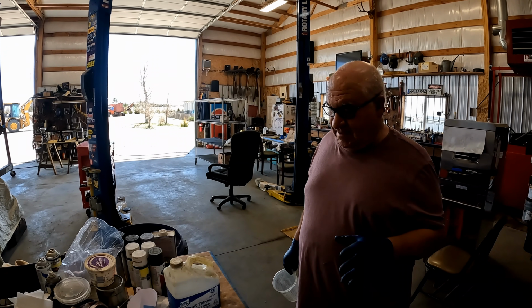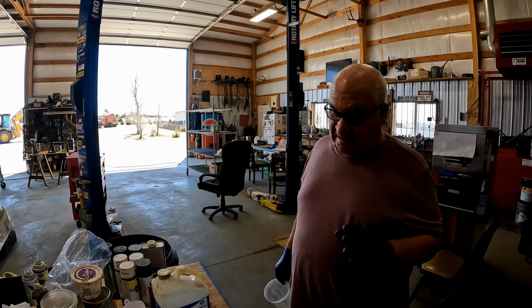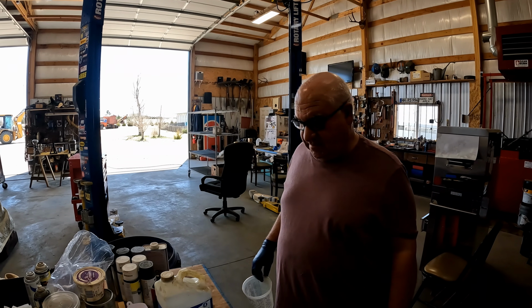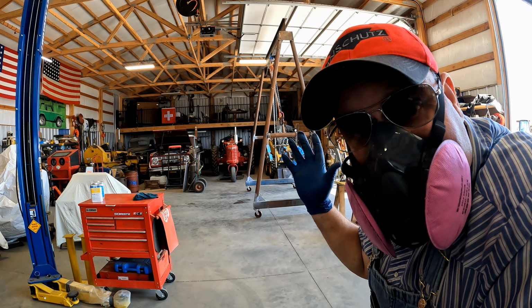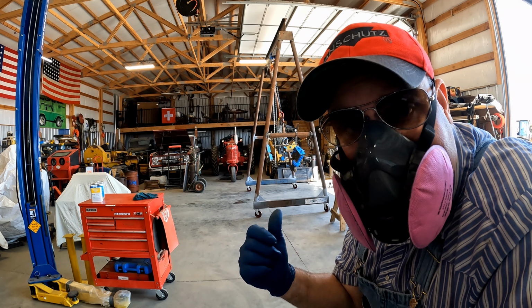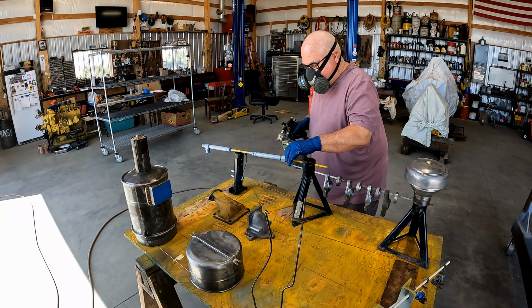But it didn't take too much. It's almost 7 to 8 parts primer to 1 or 2 parts thinner. It's been working good. We got the regulator set back up to 40 psi, and that seems to be consistently what works best. Warm enough, and the wind has luckily let up, that we can get a coat of color on later this afternoon. Good, don't it? Yeah, it does.